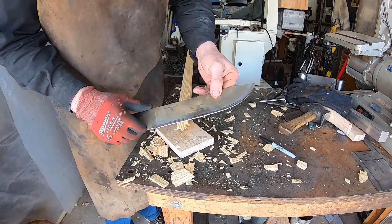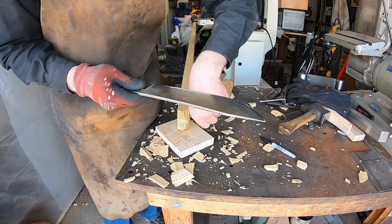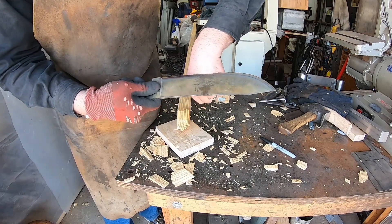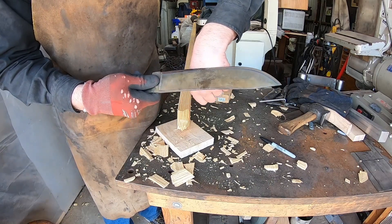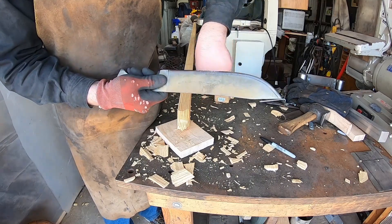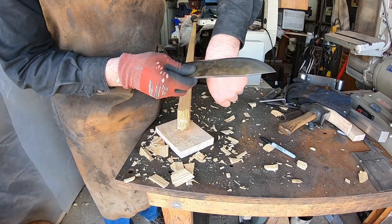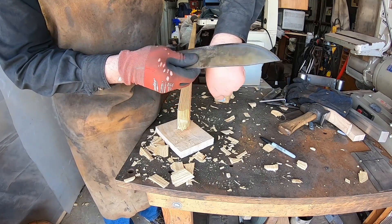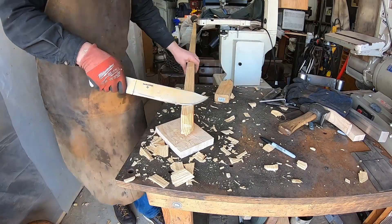Just like I miscalculated material for the tang, I also made the edge too thin for this particular knife. For a chopper — not a slicing knife — I had to go back and redo that. We were able to get through the 2x3 four times and still take hair off, so that's good to go — a nice tough blade. If you have edge deformation, make sure your heat treat is good and then check your edge profile.